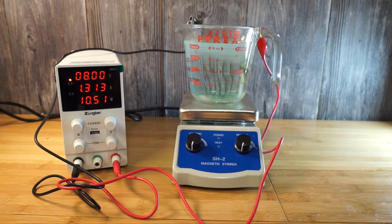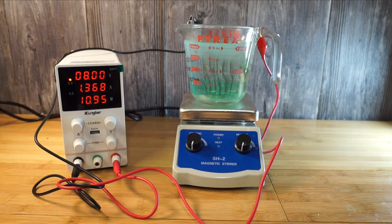I'm going to speed this way up — this is about an hour and a half of time. You can see the color is starting to go darker and darker turquoise. I apologize for the slightly rolling shutter effect from speeding it up, but pay attention to the color — you'll see that dark turquoise forming at the bottom of the cup. What's also happening is it's starting to break off little tiny microscopic pieces of nickel into the solution. When you transfer the liquid out, you want to make sure you filter it — I'll show you that step later. We're almost done making the solution; once we get to the darker teal color, that's good enough.